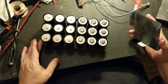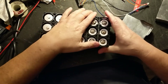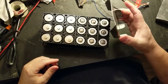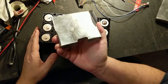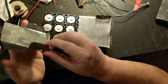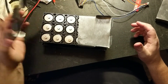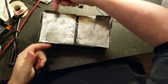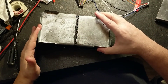Let's hook these up. First, put another cell holder on here to keep everything nice and tight. Everything has a magnet. Make sure — double-check — everything's positive on this side, negative on that side, and there's no magnet stuck underneath. You can see the layer of grease on that. Boom, snaps together. These tabs bend up and down to keep everything lined up, and they're purposely cut too short to cross over.